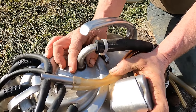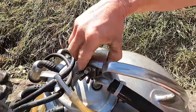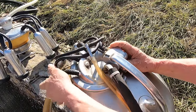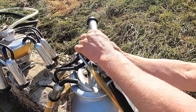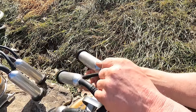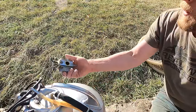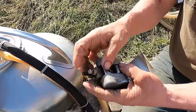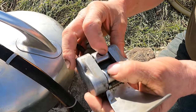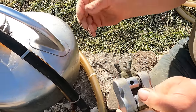Right now this machine we used to milk our fresh cows with — this one's been changed around from some of the modern stuff — but right here there was a peg sticking out where this attached and it would turn on. Your airlines, which are these for your pulsation, would go in there — one for each, you got four — and that's what you call your inflation. Those rubber parts get changed out every third or fourth month depending on how many milkings. On any system, inflations always get changed out.